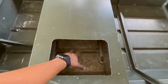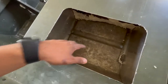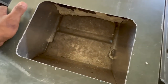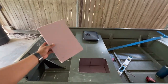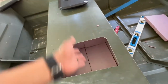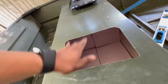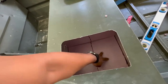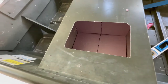Really, all I needed here is a battery and then a bunch of switches going on the wall here, so I don't need a whole lot of space. I just need to make sure I get it weatherproof — I'm going to put some sort of pieces of subfloor to raise it and then a floor, thinking about just pink styrofoam. I got some one-inch sheathing insulation and I went ahead and lined off the inside of that bad boy — nothing to it. I just measured the square, cut it, then cut it in half so that it could fit through the hole. Same thing with the backside: measure the width and the height, cut it, cut it in half. I came up with four little pieces. I'll use some liquid nails to get this down, put some weight on it, and then probably paint the whole thing black or throw some carpet on there.